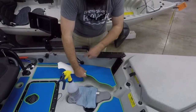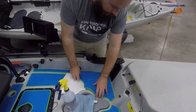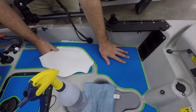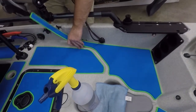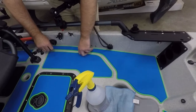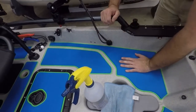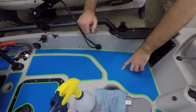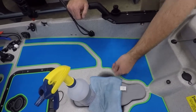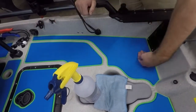We're going to lay it on the side. This tail end back here is not going to adhere yet, so we can get that squared up where we want it. This one we want pushed all the way to the edge, and it's going to sit nice and flush right there. I'm going to start with that edge and get around this fish finder here. I'll pull this off all the way, keep my hands to the top side, get it pushed back, and then sit it. As we apply that, we want to make sure it makes contact and eases its way down so we don't get any air bubbles underneath. An air bubble can cause extra fatigue on the matting, or if it's to the side it doesn't get adhered — you start getting water and debris under there, which reduces the contact of that adhesive. We like to stick it and try to roll it all the way down.